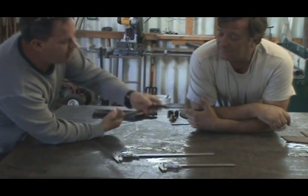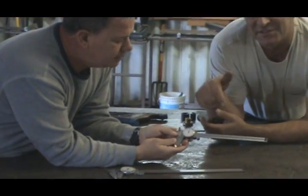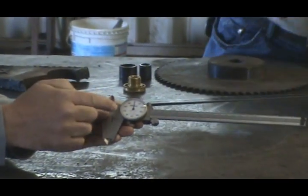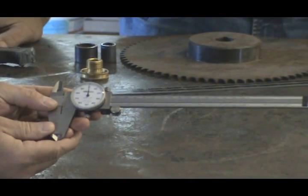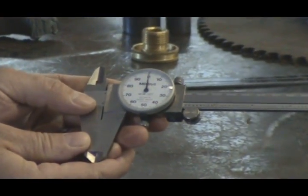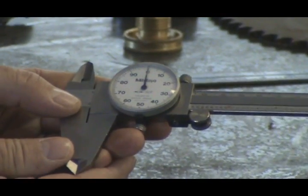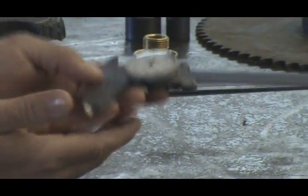Let's grab the middle set here. This is an 8-inch and this is a dial caliper. The dial caliper is set up at a hundred thousandths graduation. So if you just do basic math with it, it's simple. You break it down like a dollar bill. A quarter inch is 250, a half inch is 500, and so forth. Every time the wheel goes around, that's a hundred thousandths. Easy.